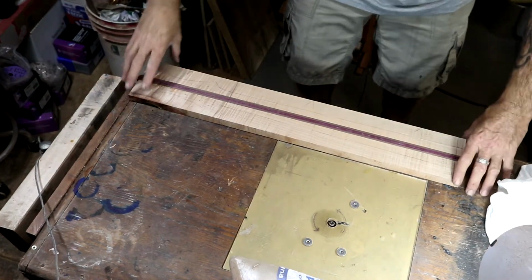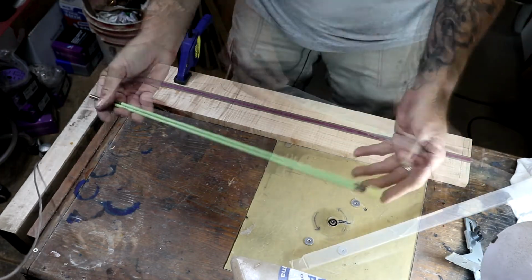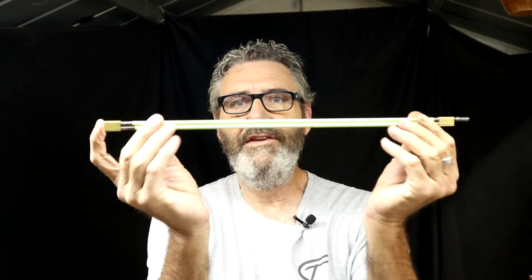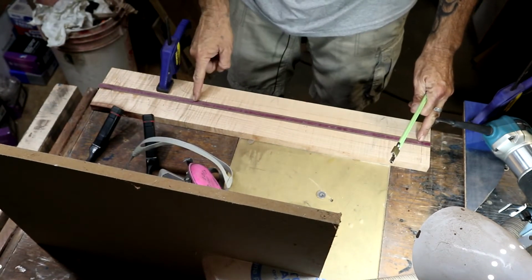So I'm going to do my normal thing. I'll grab my edge guide over here for the Makita. I'm using this Geiger. It's got solid brass ends on it. It is a dual action truss rod. So I've measured between and found the center between where the nut's at, so the beginning of the fretboard, and where the 22nd fret's at. And then I flipped the truss rod back and forth and discovered that this particular truss rod, being shorter, is a 420 millimeter truss rod from the end of this brass block to the end of this brass block. I prefer a 440. So my recommendation to Geiger is, I love this truss rod design, but make us one in a 440 millimeter. I put a mark, that is the center between the 22nd fret and the nut line.